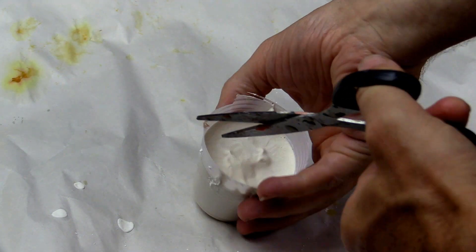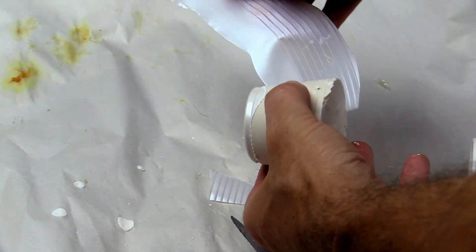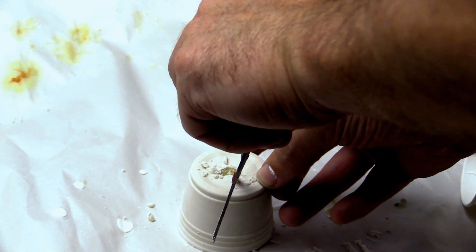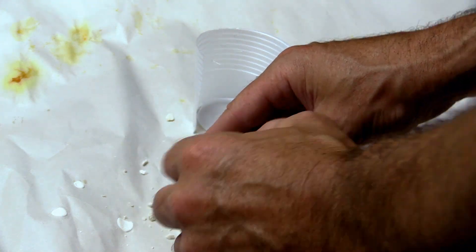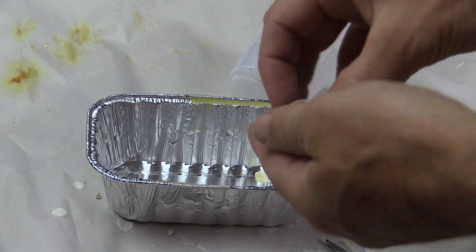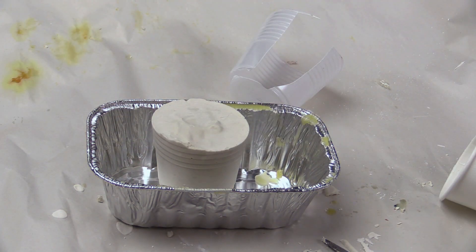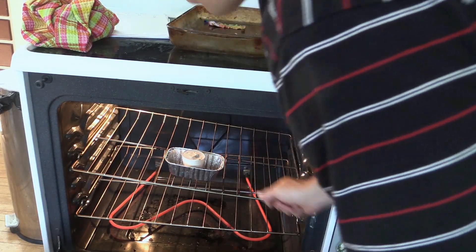Cut away the mold box to remove the plaster mold from the cup, and now comes the lost wax process. It's called the lost wax process because we're going to remove the wax from this mold. The eagle wasn't quite on the bottom of the mold so I had to chip away a little bit of the plaster to create a hole to pour out the wax and a hole to pour in the metal. I flip the mold upside down and melt out the wax, using a few stones to keep the mold up in the air so the wax has a place to come out. You can reuse the wax. I melted out the wax at 350 degrees Fahrenheit in an oven for about 20 minutes. Don't let this wax overheat because it can catch fire.